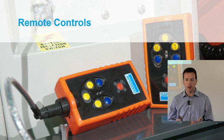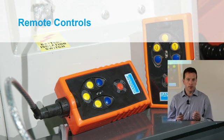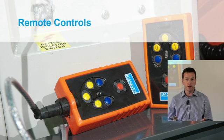We also supply a start-stop remote control for the feeder operator. The operator has the remote control in the cab of the loader, and he can control starting or stopping the feeder on the QE341. Thereby, he can eliminate any potential issues before they become a problem, because he has full visibility from the cab and he's able to use the remote control without having to get up and down from the unit to intervene with the operation.